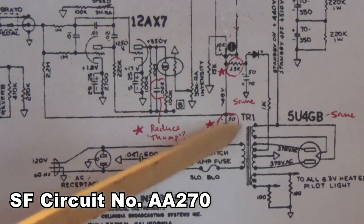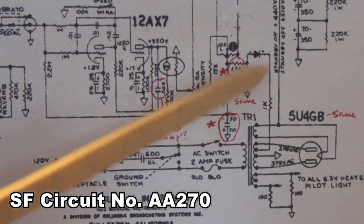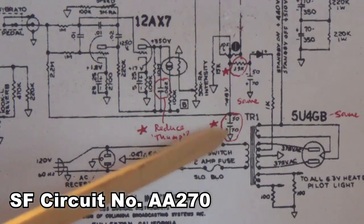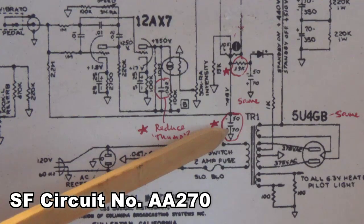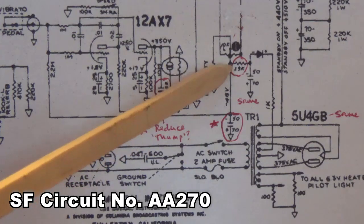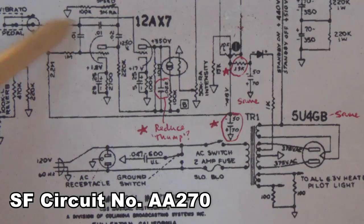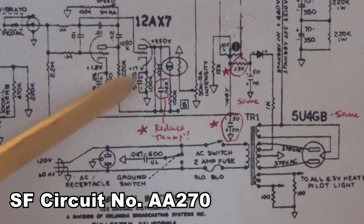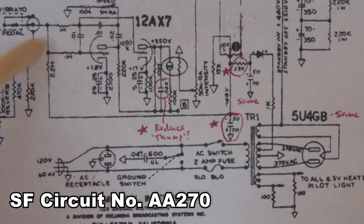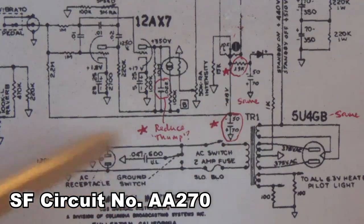Also, they did something here that's kind of unusual. Now, we're used to the 50 microfarad at 70 volt filter cap for a negative DC bias supply. Well, they put in a second one right here. I think that's rather unusual. Why, you might ask, do they bring it down here and come over to our oscillation loop for a tremolo? The understanding I have is that it kickstarts the tremolo loop so that the second you turn the loop on, it will start oscillating.